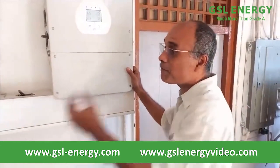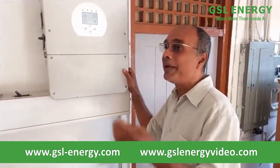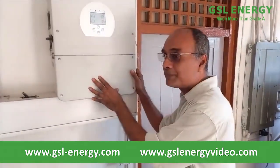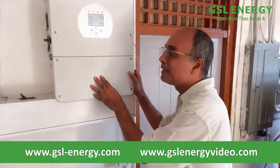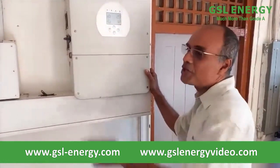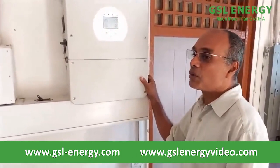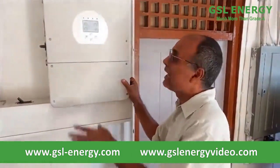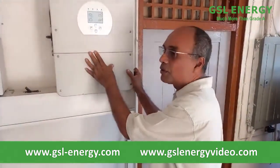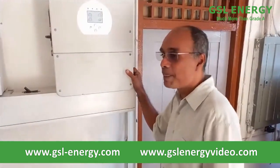So what happens? The solar panels actually produce DC power. And when it produces that DC power, it goes to the inverter that takes this DC power and converts it to 48 volts and charges the batteries. So these batteries are 48 volt batteries. It charges the battery, and also it takes some of that power and converts it to AC power to supply your load. Because in my house I'm using AC power.